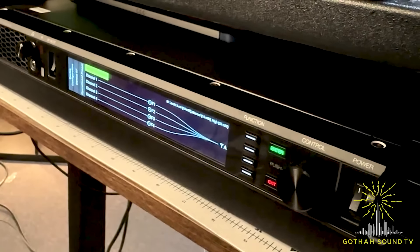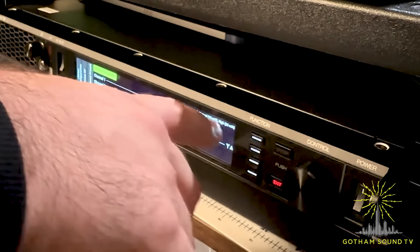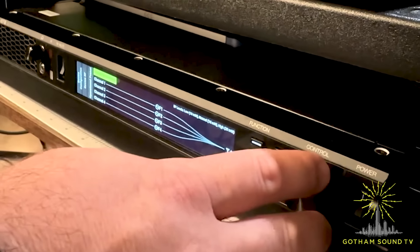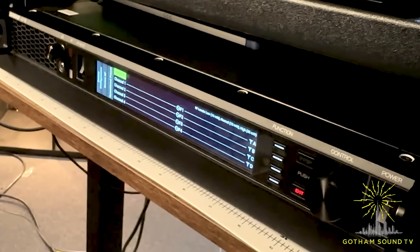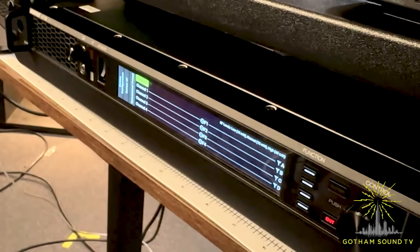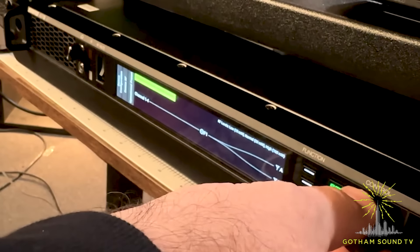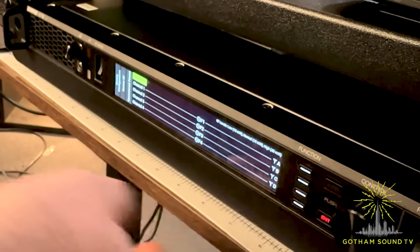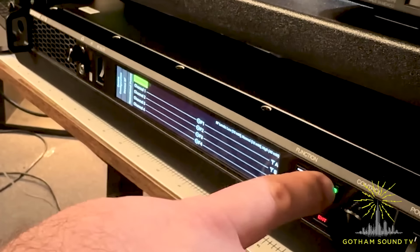What's the RF output from each carrier with analog FM combined? It would be 20 milliwatts all in for each combined output, based on FCC regulations. And then analog FM discrete — if you did discrete outputs you would get 40 milliwatts at each output of course. It visually lays it down for you here, which is nice. It also gives you guidance on which ones to plug the antennas in and what the output power is. You can scroll through to your heart's content. Right now we're going to go narrowband — one frequency with a stereo audio out of antenna A at 40 milliwatts — and see what happens. Before we go, we'll scan to make sure it's on a clean frequency.